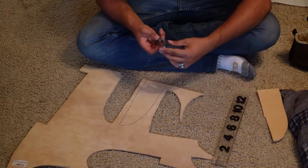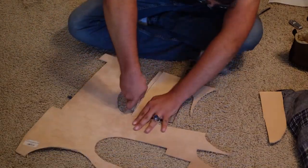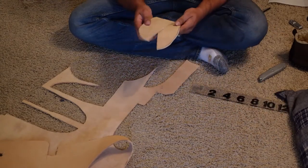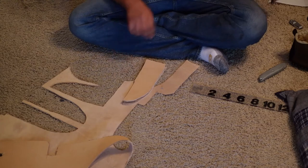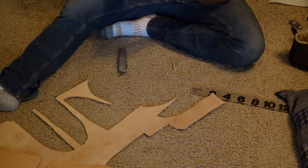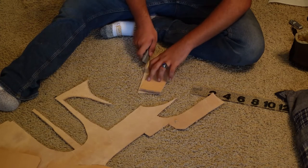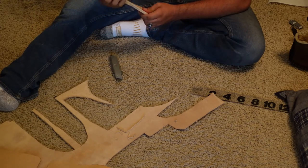There's one down. I'm going to use my usual knife on this next one because I think this thing needs a bit of a thicker blade for leather work. Now, real quickly, I want to trace these on top of each other because I know for a fact there's going to be a couple of differences between the two, and I want them to be as close as possible. Bear in mind also a lot of the small correction details can be taken care of with the belt grinder. That's good for the time being. I can correct the rest of this on the belt grinder.